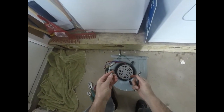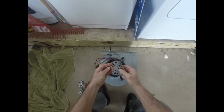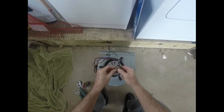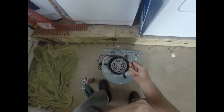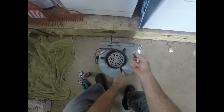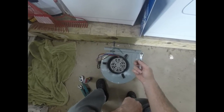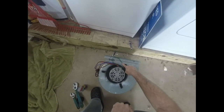I removed the bolts — or attempted to remove the bolts — from the mounting bracket here. This is so corroded; I live here in Florida, pretty close to the ocean, so it is highly corrosive conditions for these units. All of these bolts just sheared off inside of the housing. We're going to need to either mount them using an alternative method or get a new blower housing. All three bolts are removed; need to make sure we get the grounding wire removed.